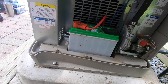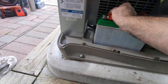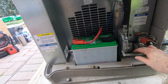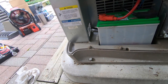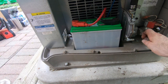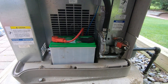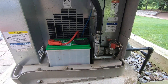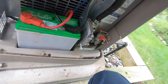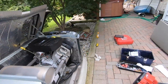So the battery definitely needed maintenance on this machine. The bolt holding the stepper motor didn't loosen this time, but a lot of times I do find them loose. The hoses needed to be drained — all it is is a vent. I'm not even sure the hoses are that necessary with a 90-degree fitting since air shouldn't ram straight in, but this was Kohler's fix. It was SB-722 — some memo they put out back in 2011 after Hurricane Sandy, because quite a few generators were having that hunting problem. You had to check the carburetor gasket, go through the controller, and change a lot of the speed controls.